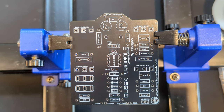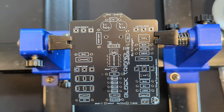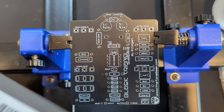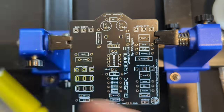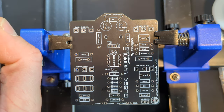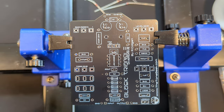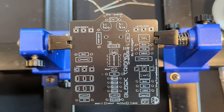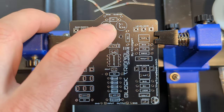What I like to do starting off is begin with things that sit low to the circuit board — like diodes and resistors. Today I'm starting off with some 1N4148s; there are five of them, plus this other diode, the 1N5817. The difference is you can use the 5817 up at D1. I label it D1 because the original Vemuram Jan Ray uses the 4148 there.